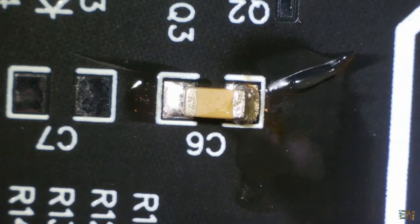Now let's see how to solder a TQFP package such as the ATmega328 microcontroller using the soldering iron. Using the flat tip, add some solder to the first pin. Take the component with the tweezers and find the perfect position. Hit the first pin again so the component sticks in place. Now add some flux to the opposite side, then slide the flat soldering tip over all the pins quickly. Do the same for the rest of the pins. If you have excess solder, add some flux and with a clean tip pass it over the pins once again. Clean with alcohol and the brush — it's not actually that hard.